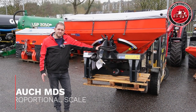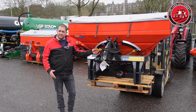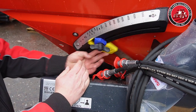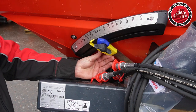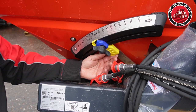Also very popular because of their proportional scale. This means that if you find a setting of 50 is giving you a bag an acre, you'll find that 100 will be 2 bags an acre, and so forth. If you found that a setting of 50 was giving you a bag an acre, this will open up to there. And if you want to go to 2 bags, you'll just double your reading up to 100, tighten up, and that's giving you 2 bags an acre.